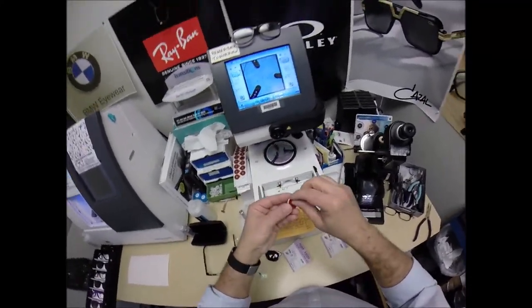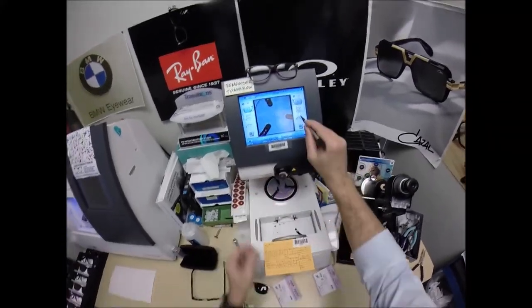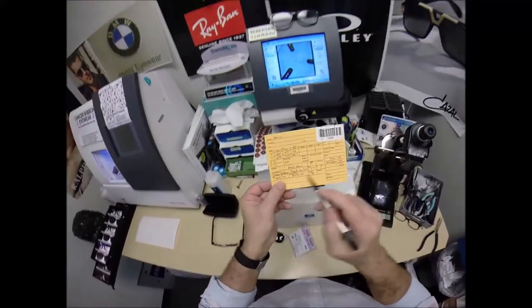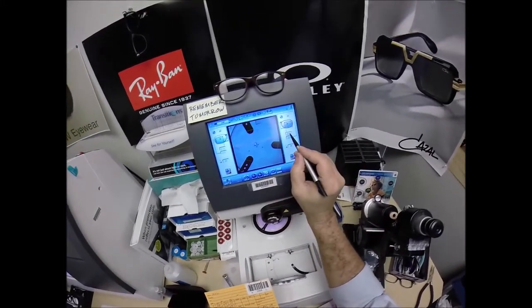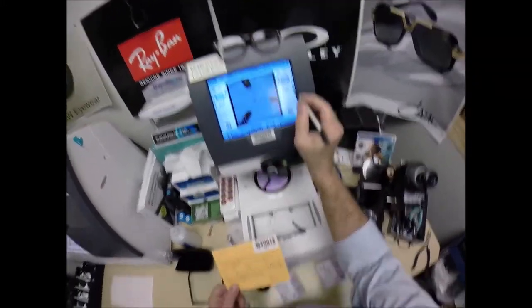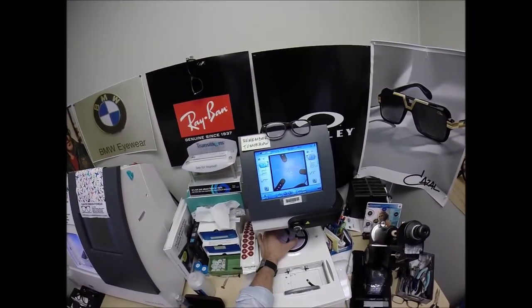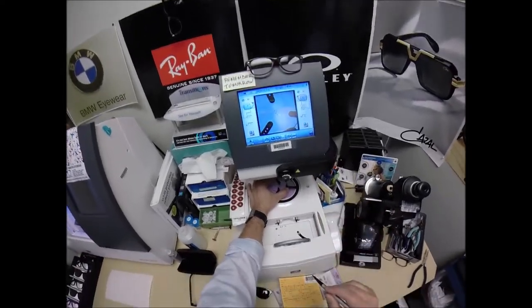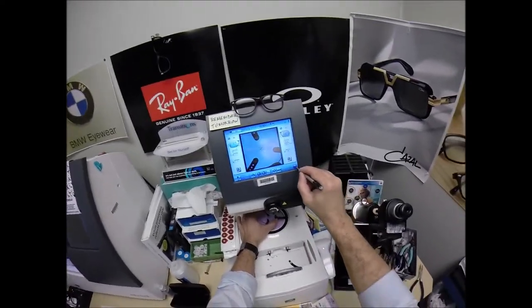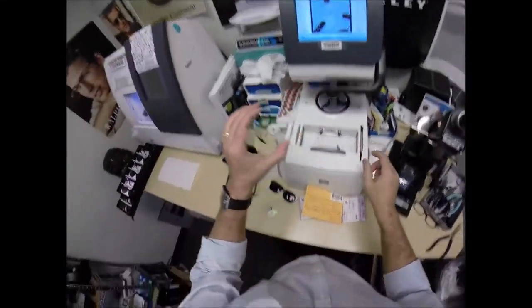Pull the paper away to make the black side sticky, line up the magnet. Pupillary distance for the left eye is 31, so I'm going to tap the minus button — that brings the value down to 31. We're going to stay with the same optical center height of 22. Place everything onto the platform and hit the button. Now it comes down and places the block onto the left lens.